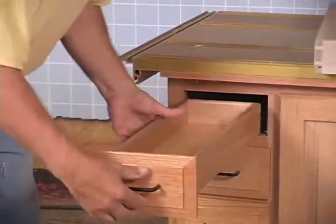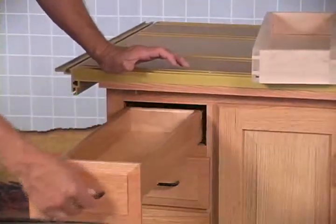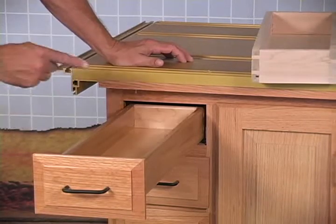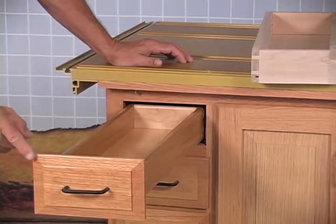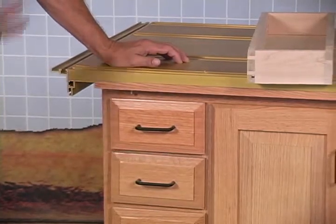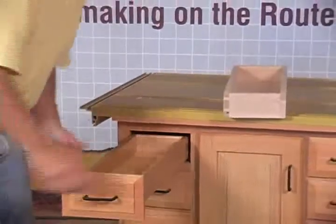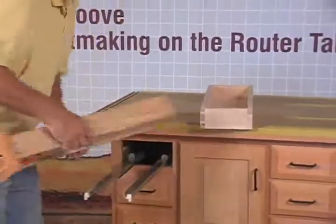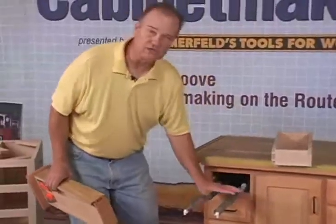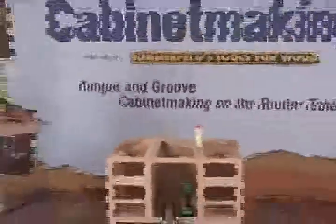So you can take this drawer on, set it down on there, push it in. It locks in those 2 clips. Now I pull it out, full extension. And what's nice about these drawer slides, you shove them in the last 2 or 3 inches, they close very quietly. Watch, just like that. So they're very nice drawer slides, the ultimate drawer slides. So what we're going to do, we'll take this out, is we're going to show you next how we have our finished drawer here, how we're going to install these slides into the cabinet we're building.